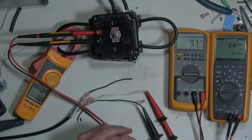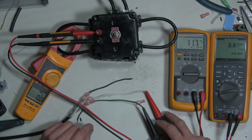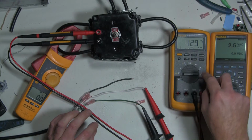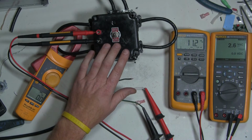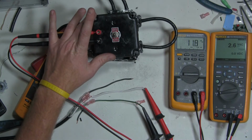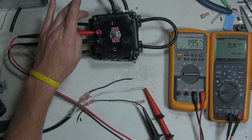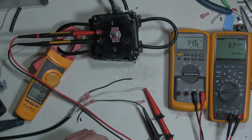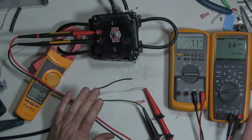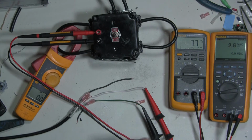The only thing that I probably would have done again before I buttoned everything back up was take one of my leads on my meter and put my meter on continuity and test different points to confirm that there's no continuity between the housing and any part of the circuit, and confirm that there is continuity between ground and the box. But that's hindsight. I don't think it's a big deal for now. I'm 100% sure that I'm connected to ground off of this post directly to the wall. So let's go ahead and energize the circuit and see what we get.